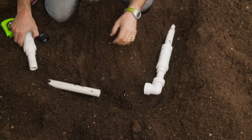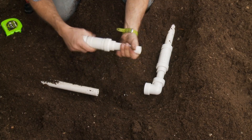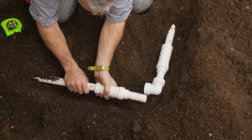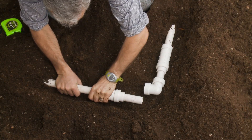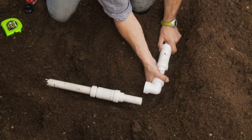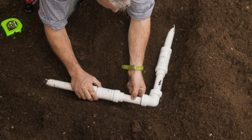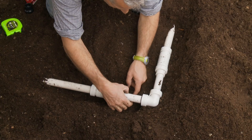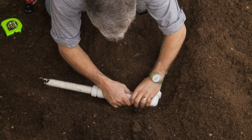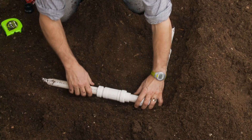And the other thing I need to do is put the slide repair on the other side of the pipe to establish the rest of that fitting. Loosen that up a little by working the fitting a bit. And once it's loosened up, you can push that in and give it a quarter turn — you can feel that slide. Now I need to telescope this fitting so that it fits directly above the corresponding fitting, making sure all the dirt's out of the joint. I extend that fitting to the joint like that and give it a turn. Fitting set.